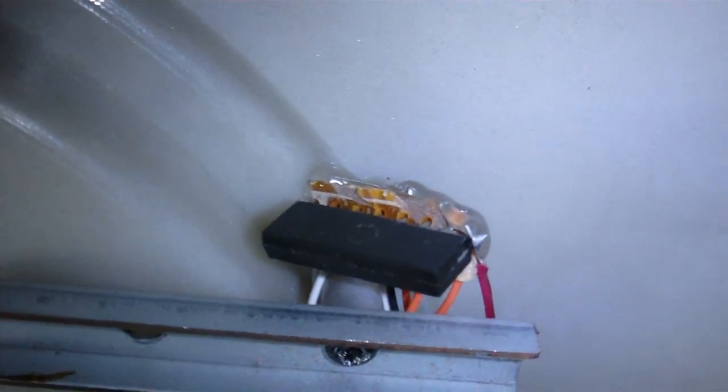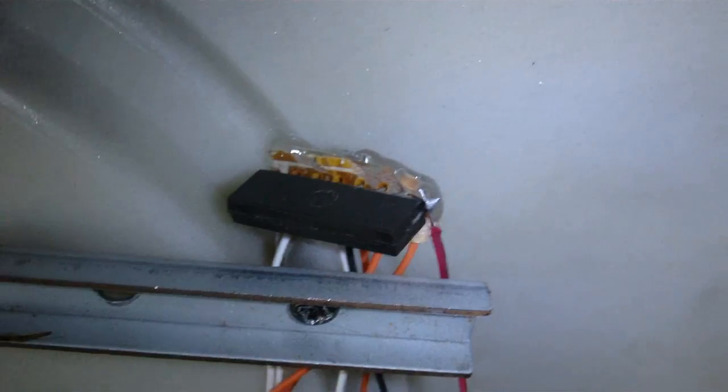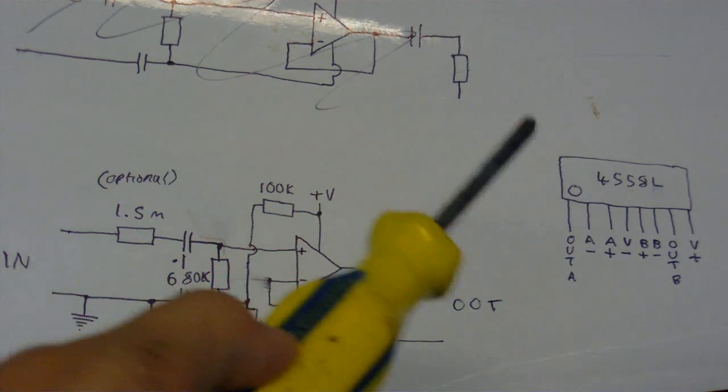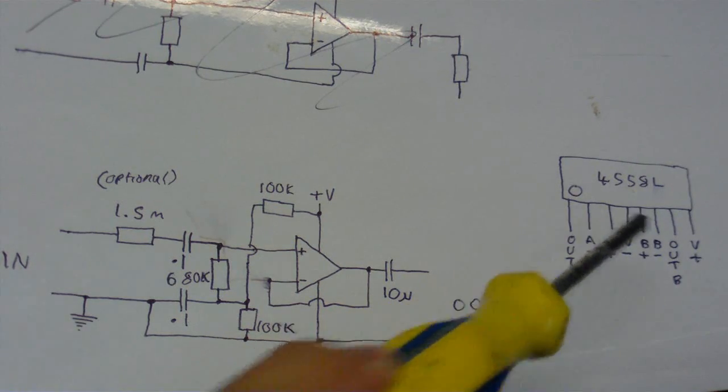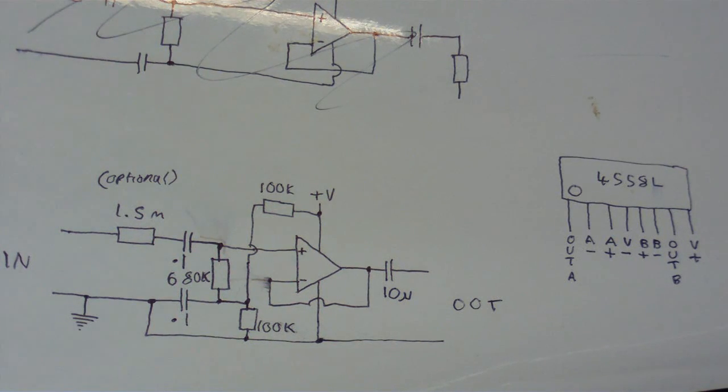Simply because I couldn't find any spare perf board, and I couldn't actually get this chip off its original circuit board — I just cut around the circuit board and did it that way. For those of you interested, this is the circuit. It's basically the Piezo match circuit. I've only drawn one channel. The only difference with my circuit is that instead of using a TL072 op-amp, I've used an NJM-4558L, and these two 100k resistors in my circuit are 10k resistors, because that really won't have any effect on sound quality.